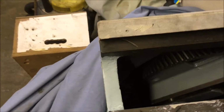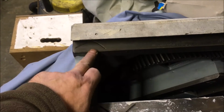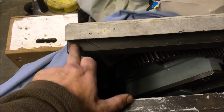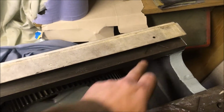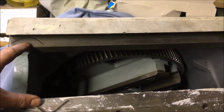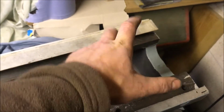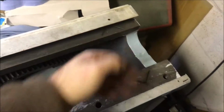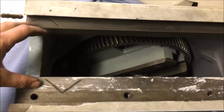So while I was at it, I thought I'd have a look at the oil ways milled into the slide of the ram, and basically that's your oil point. Picks up down here, and there's a mirror of this on the underside of this dovetail, and then nothing all the way along to the other end. Now I guess the end's where you're going to get the most wear, but I would have also thought that the wear on the front end, which is that end, would be lift, and then the rear end would be a drag, downwards.